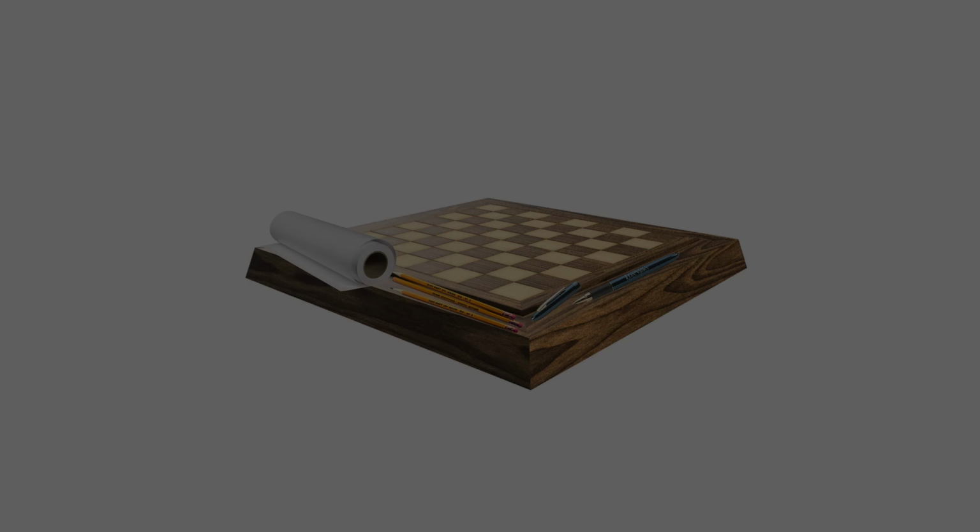The last part of the box, and probably the biggest improvement over the original design, is the piece organization that goes inside. The first version didn't have this, and I definitely regretted not doing it, so I'm glad I put it into this one. I just used some thin strips of walnut and cut cross lap joints using the drill bit technique, which worked great. I'll put a link in the description to a video we did recently that goes over this method in depth if you want to check it out.